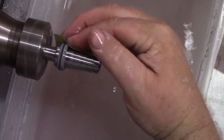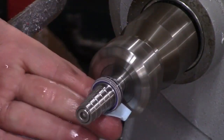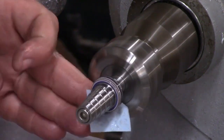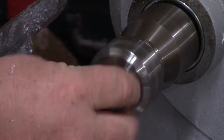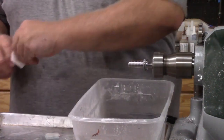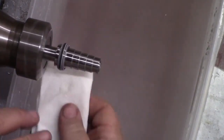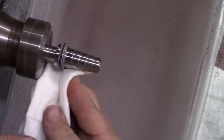The whole sanding and polishing probably takes less than five minutes. I jump to Zona paper — working through all six grits with water — and you can really see that ring start to shine even through the water. Then I use Ring Bling, which is like step six of the Magic Juice. One drop is all you need — it cleans and polishes the ring, giving it that little extra shine. I use this on pens too. Surprisingly, Fordite takes a shine really nicely.